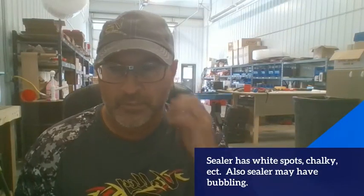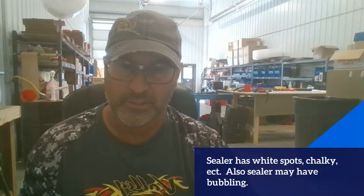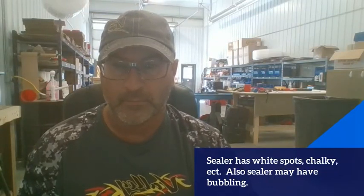The first thing, we're talking about basically two things. The surface of your curb can get kind of white and chalky sometimes. They call it efflorescence. It's the salts and minerals that come to the surface of your curb as it's curing. As it's expelling that water while it cures, it'll leave those deposits on the surface. Those can be caused by all sorts of things, and that might be another video. But there's certain ways you can fix some of those color issues.